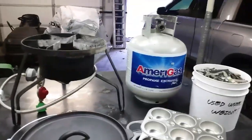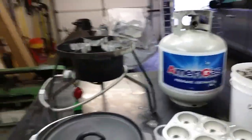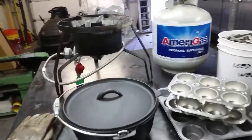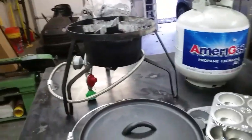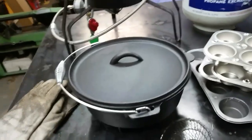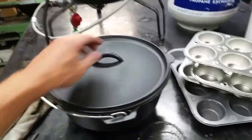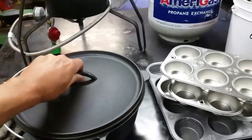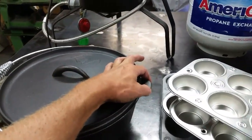We've chosen a nice, cool day and we're ready to get started. Before we actually light the burner, we want to make sure that we're dressed appropriately. This is not the kind of job you want to do in flip-flops and shorts. I'm wearing some leather boots, some durable blue jeans, a shop apron, a t-shirt, some safety glasses, and I've got some gloves. The equipment we're going to need is some kind of a propane burner, some propane, and a pot. I like a cast iron pot — I just picked this one up from Walmart for only $17. It holds a good amount of lead, comes with a lid, has a handle that shouldn't get too hot, and a tab that will help me tip the pot if I'm going to pour straight from it.